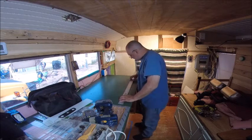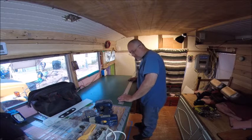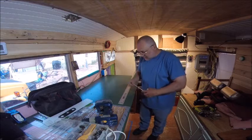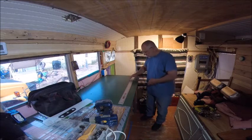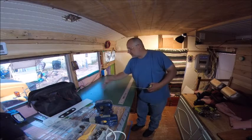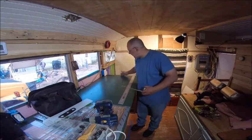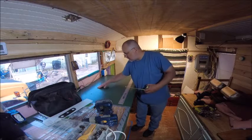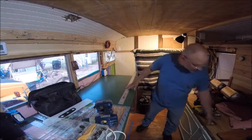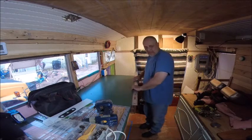Using my straight edge, I did two things: I lined it up here with the holes, and also using a tape measure I made sure the distance here and here was the same from the edge. Also from the sides and from the back — from this side to here, and then from the back. This is going to give me my four lines.